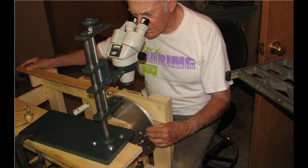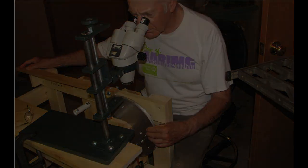We'll get farther into it, but there is a strip of tape that is upside down on the mandrel before we start, so that the sticky side of the tape is up. The idea being that will hold the wires in place once we start to take it apart. To help hold it in place, we actually put a second piece of tape on top of the wires before we remove it from the mandrel. So the wires are actually held in place by sticky tape both under and over the band. But the wires are laid side by side in a flat cable.